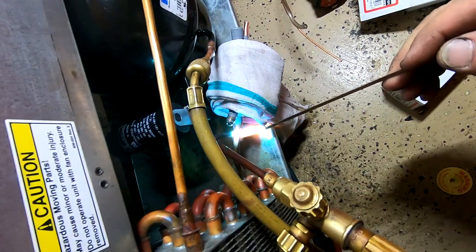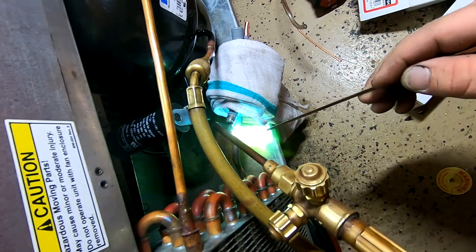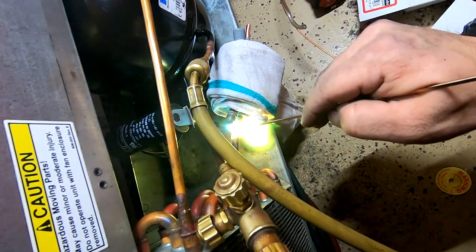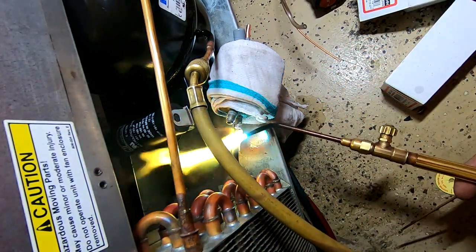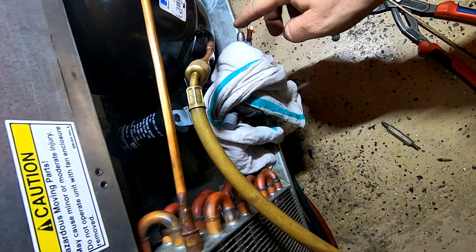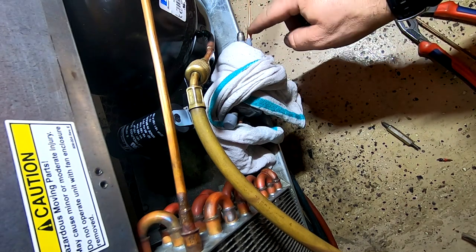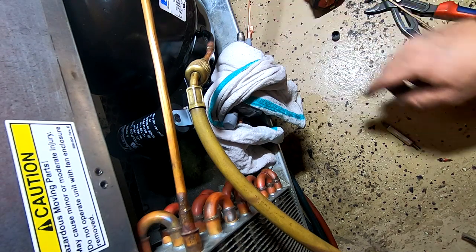The reason we're using a small quarter-inch piece of tubing between the dryer and the line coming out of the condenser coil is because it was some weird off-size that I didn't have on the truck and I had no fittings to adapt it. Right now I'm bleeding through at higher than normal pressure. Wet your finger and you can feel it plain as day — any higher than that you can hear it. I'm one notch down below that. I've bled everything through, so now any back pressure from restriction is going to come through here — we're just displacing the oxygen.